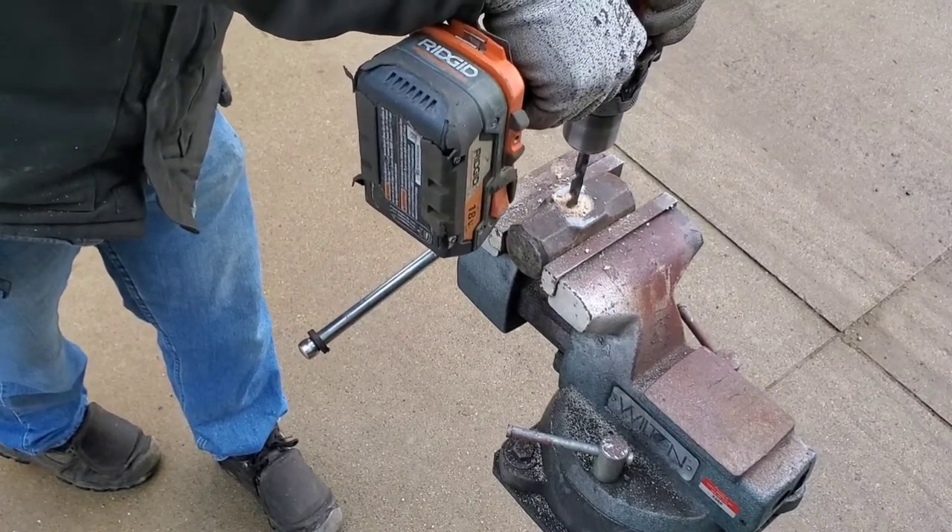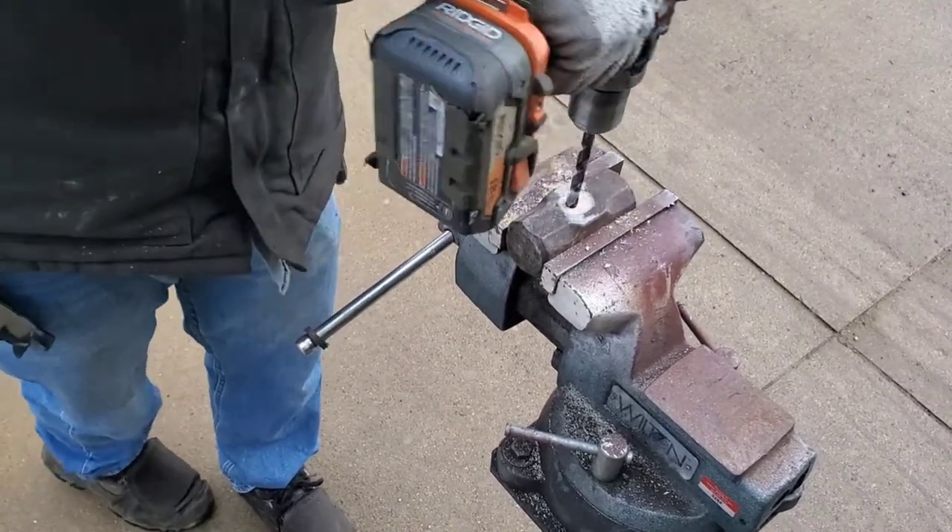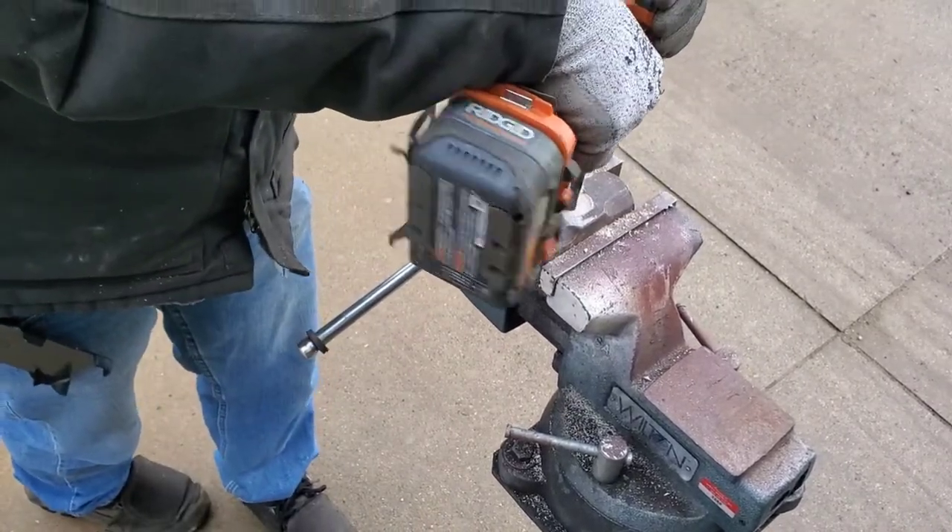You want to be careful because this drill bit will get snagged on the metal wedge down inside there — it'll grab hold and twist your wrist around or break your bit.